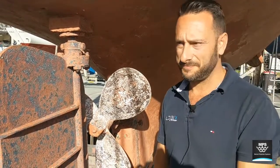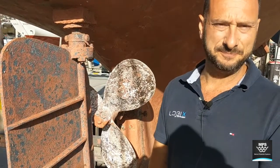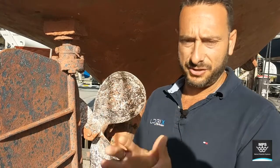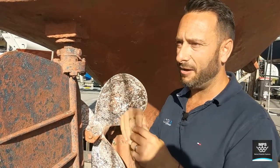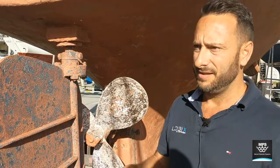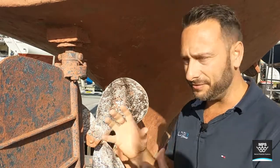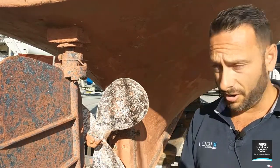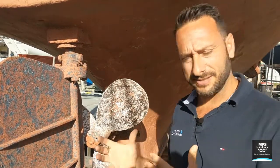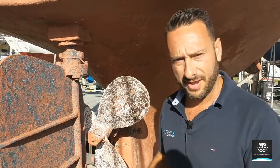If you see any evidence of this — either by using the vinegar test or by observation when you're on the slipway — what should you do next? I would particularly recommend consulting a timber boat specialist to determine how badly degraded the timber has suffered, and then from that we assess the anode situation. Every single timber boat is different — they have different makeups with different types of metals used — and therefore you've got a case-by-case scenario to determine where the anode is going to go, what metal we have, and the reasons why.